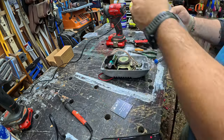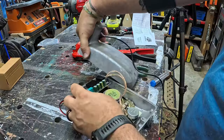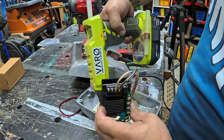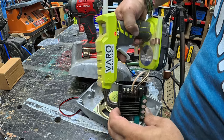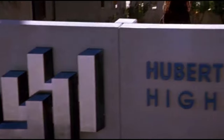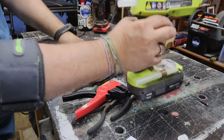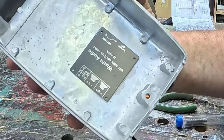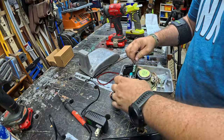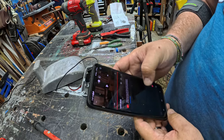I had to take the power plug over to the grinder for a moment to get rid of some of the plastic jacketing that was around the plug, so it could fit through the hole that was already there for the power slash speaker cord. To hold the Bluetooth amp in there, once I tested that it fits, I just used a healthy helping of hot glue. Also, while I had the hot glue out, I took the aluminum wiring diagram slash manufacturer information that was provided with the amp and hot glued it to the back of the case, so in case in the future I need to crack this open and find out who the manufacturer was and where the speakers connect to, I know that information down the road — helping out future me.